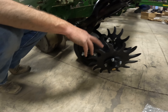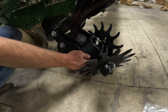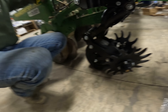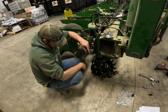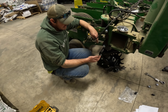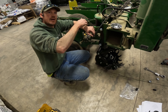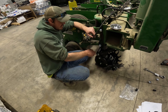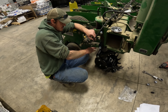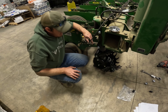We're also going to set these up so they're staggered. The other way you can have them is in the middle hole, and they'll be somewhat interlocking and turn like this - but that is a lot more aggressive. Most guys are going to run them in those holes at that setting. Even the way they were set before, because it was fixed, you'd be digging in some spots and not even touching the ground in other spots. These are going to be uniform across the whole planter because they travel separately, and that's why I'm excited about these.